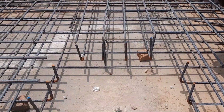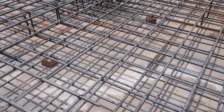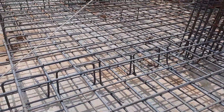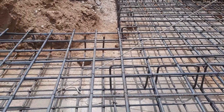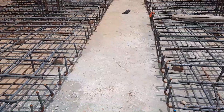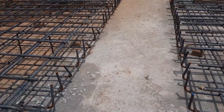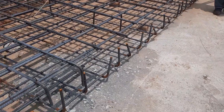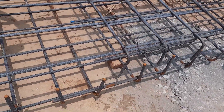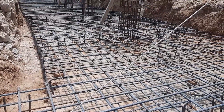After completion of this bed, they will start the concrete pour. They will make M20 grade concrete for this construction. The chair diameter is 12 millimeters, and the main bars and distribution bars diameter is 16 millimeters.